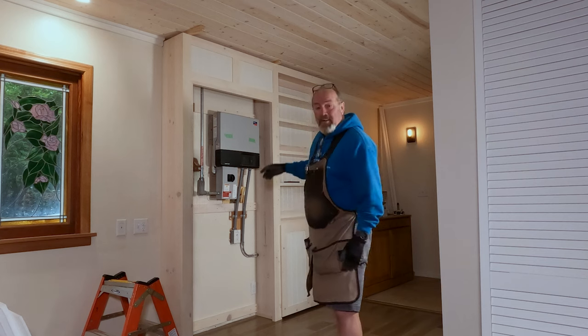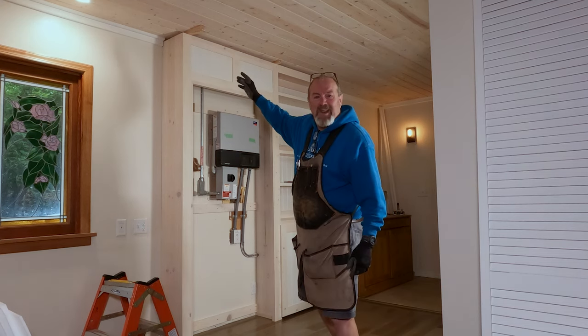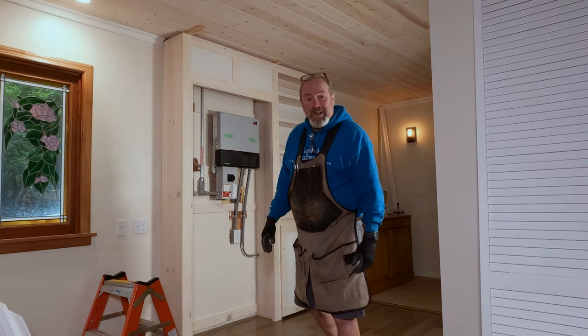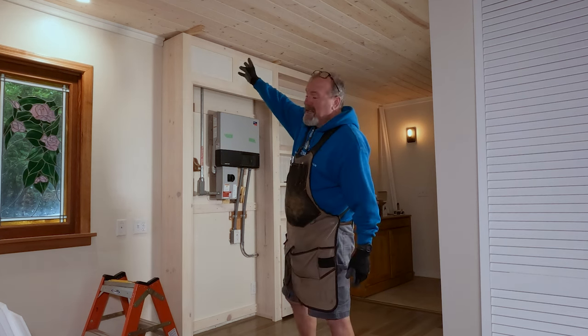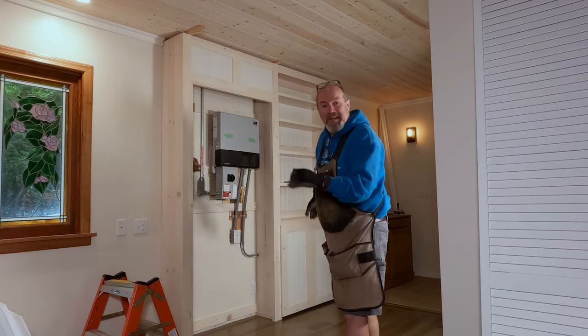There it is. Coming back tomorrow. We've got probably 5 hours in it today. You saw me trying to get the crown off. That was kind of a pain in the butt. Same with the floor molding. When you don't have the right tools, it makes it harder. That's my fault. Anyway, so tomorrow we're gonna hang the bifold doors, gonna run the crown. I'm gonna cope it around, hopefully, and fit it into there. We're gonna caulk all of that into place, and it'll be done.